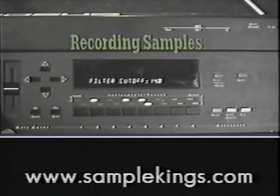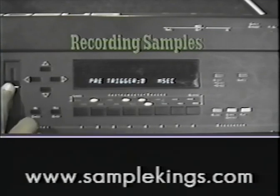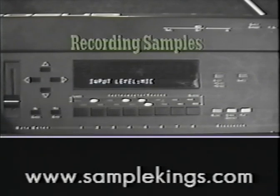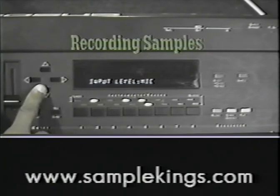Third, we have our pre-trigger. This parameter causes the EPS to start sampling before it reaches its threshold level. So you may have extra time at the top of your sample that may have to be removed if you set this too high. Our next parameter is the input level. We have two choices: one of which is mic for a microphone, or line level for a turntable, amp, or keyboard.